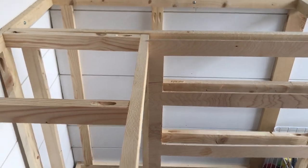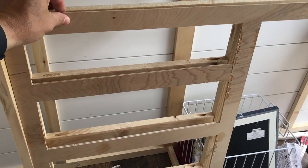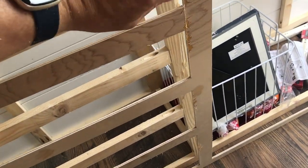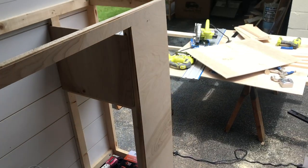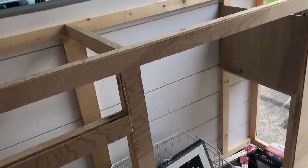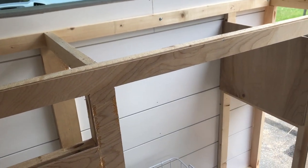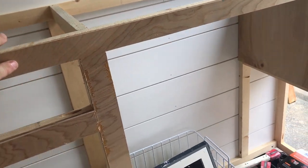As you can see, I have the skeleton of my cabinetry built for the kitchen counter. I've gone ahead and taken quarter-inch ply as a face plate and cut them all out. I did make one little mistake and accidentally cut all the way through, but overall I did a pretty good job. I got a new tool — a circular saw tracking system — so I can cut nice straight lines. I used that to cut out my face plate by simply lining up the track, dropping it in the middle of my lines, going all the way to the edge, then finishing off the little edges with a jigsaw.